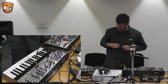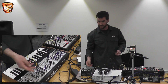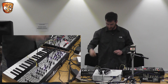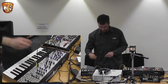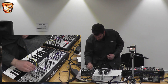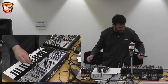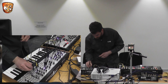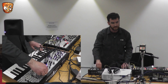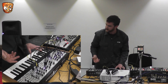The other thing we want to do is use a gate signal and another envelope to control how the filter sounds. The gate out of the key scanner only has one patch point, so I'm going to patch it through a buffered multiple, which just gives me copies of the signal to send elsewhere. I'll run it into two different envelopes and patch the second envelope into the filter's frequency modulation control. Now you have a second envelope controlling that, and it sounds a little bit more like a classic synthesizer.